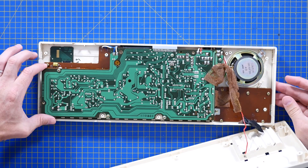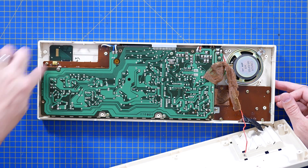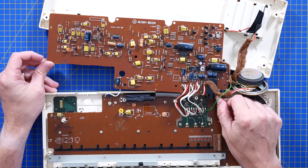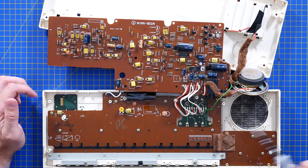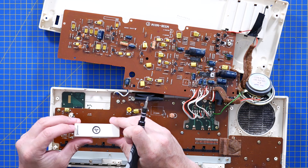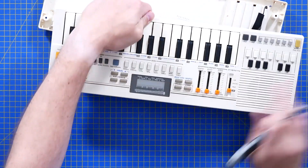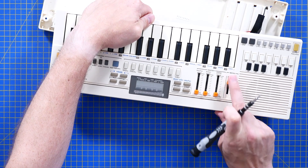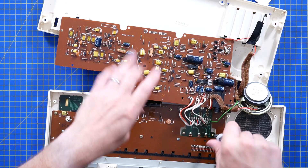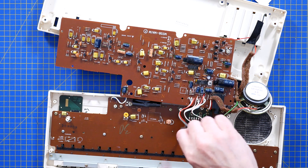Lovely looking board — big traces, like really big traces. I'm guessing power and ground bus run all the way around the outside, get smaller by the other end. That's the kind of aged board I was hoping to see here. There are still lots of daughter boards — it's not even just two main single-sided boards. There's daughter boards here and here as well. That's the interface card that made contact with the ribbon — the zebra strips there. That looks like the display ribbon. That's the analog interface board, which has probably got the three potentiometers on it, leaving me to think maybe this is an analog audio amplification board and this is more the digital side.